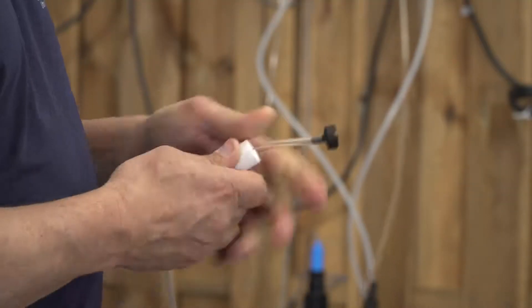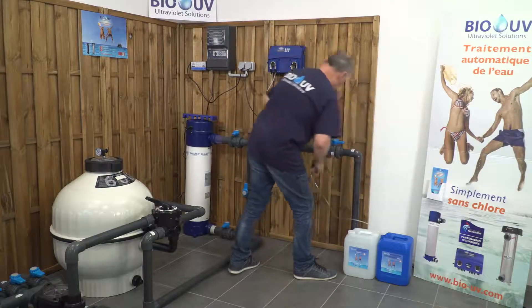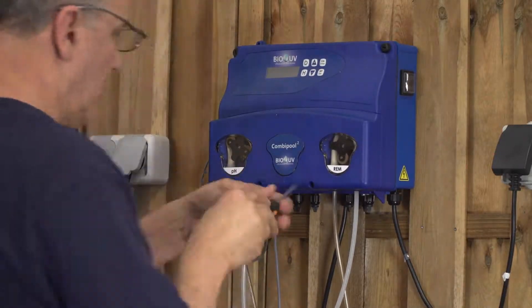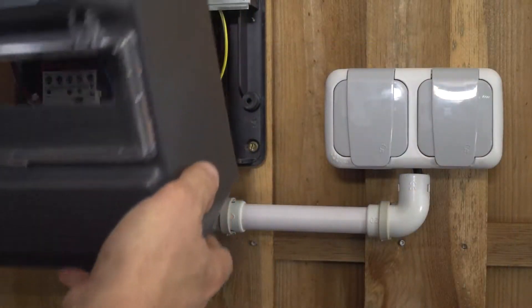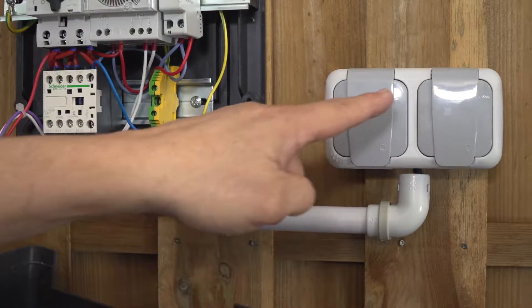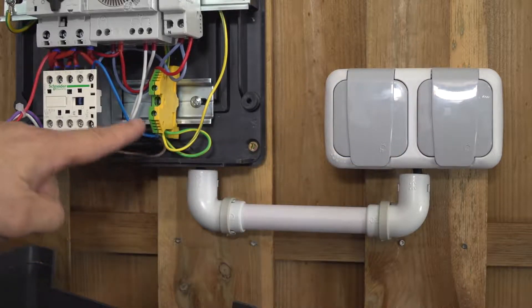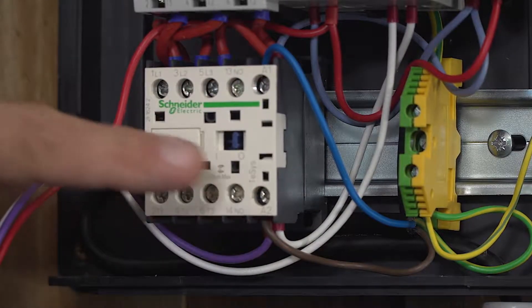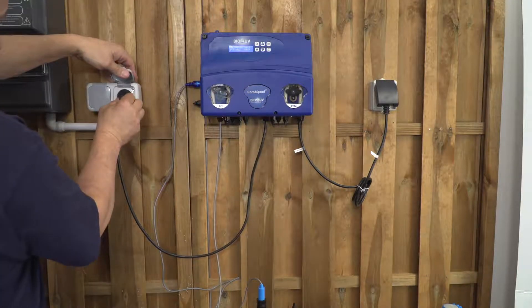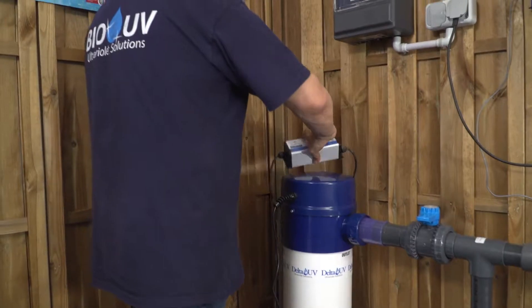Be careful — you have to respect each job according to every regulation. Fix your front face again. The electrical connection is going to proceed through the filter and control box. Dismount the unit, check your two plugs, and then connect your units on the A1 and A2 filtration plugs which are located in the filter and control box, and then connect the combi pole.